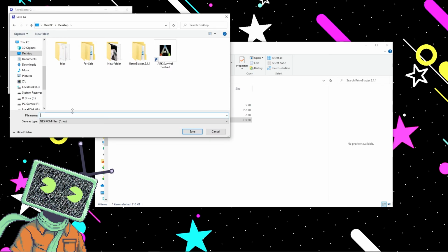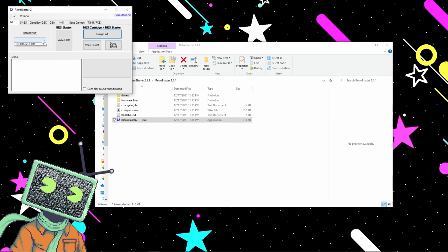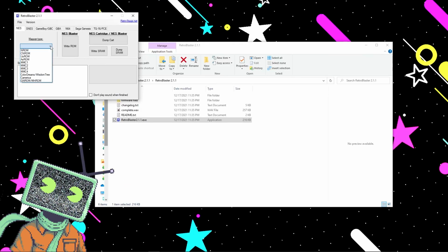Alright, let's go ahead and name it the game, which is Bubble Bobble, and hit save. It's saying that we don't have a mapper selected, so let's go ahead and select the mapper. If you don't know which mapper it is, I've included a link in the description that has a list of all NES games, or pretty close, and their mappers. After referring to the list, we need the MMC1 mapper, and let's go ahead and click dump.